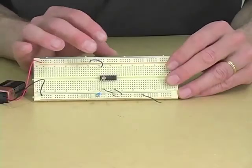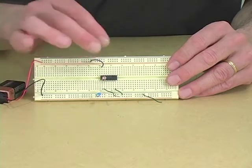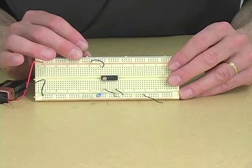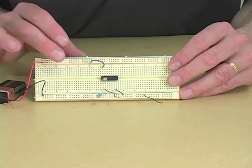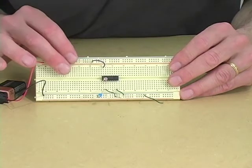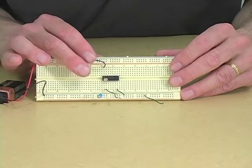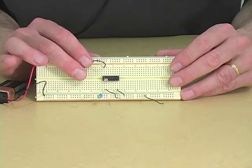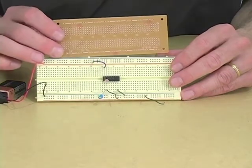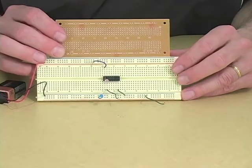The breadboard is a great solution to the problem of making and experimenting with circuit designs. You can connect and reconnect components without solder quickly — it's an easy way to run through variations. However, it's not terribly durable. You can glue one down into the bottom of a cigar box, but at some point you may end up wanting to solder up a version that's a little more solid. For that purpose, you have to buy yourself a PC board — a printed circuit board — that mimics the form of the breadboard.